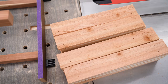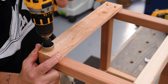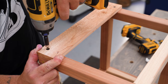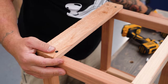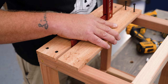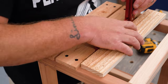With the pilot holes drilled I can start installing the short slats. Working from the top of the frame, I flush the top and sides of the slat to the frame, drill into the pilot holes with the countersink bit, and then fasten the slats down with these black inch-and-five-eighths deck screws. You need 144 black screws for this planter, and as it turns out not all one-pound boxes of black deck screws have enough in the package. I ended up running out and had to get more, so I'll leave a link below to the ones that have just enough, as well as the countersink bit I used and some other stuff you might find useful.